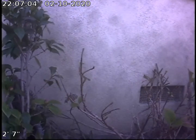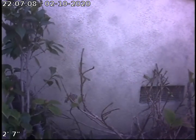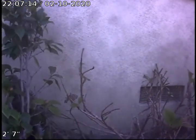We were out here this morning and we ran a camera and we were unable to get past the curb area. It was compacted with tree roots. We hydrojetted the area and we've checked the sewer line while we were running the hydrojetter, and we found that there's a major break at the curb area in the 6-inch vitreous clay.